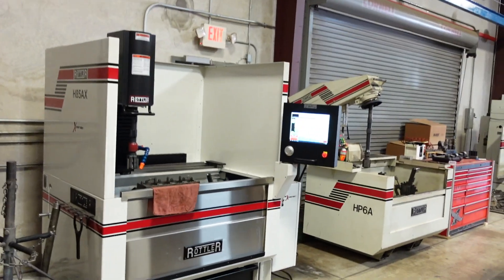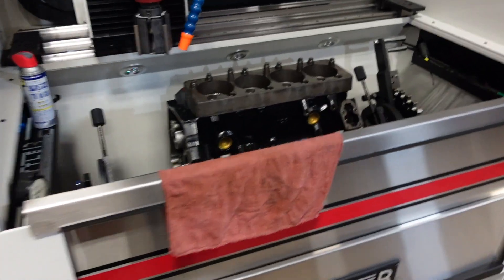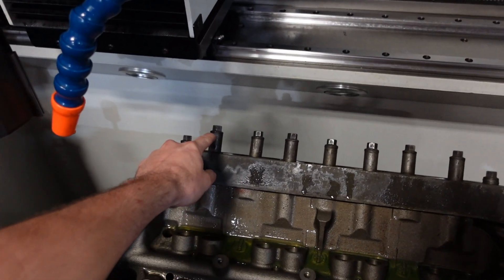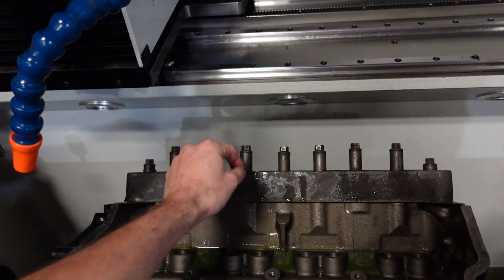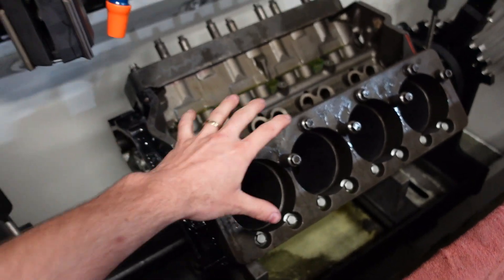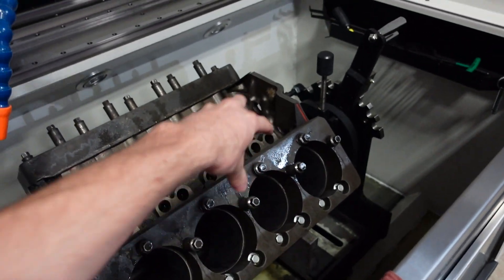I have been playing with our Rottler Hone this week. This is our fully automated new CNC H85AX cylinder hone. Right now I'm finish boring — finish sizing a 383 block. We've got our dual torque plates on there, and we even run the correct length head bolts so that the stress in the block is as accurate as we possibly can for honing. Basically these plates put a stress on the block, they pull the cylinders a little bit out of round, so when we hone it straight, when the cylinder head gets torqued on for real, it pulls everything back straight.